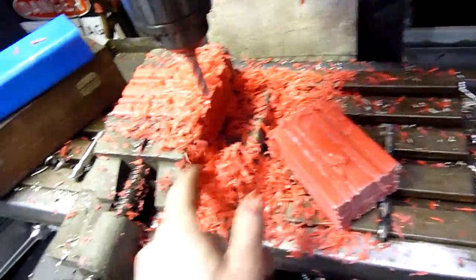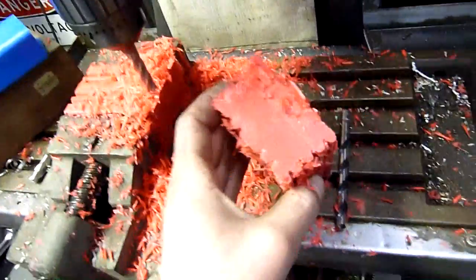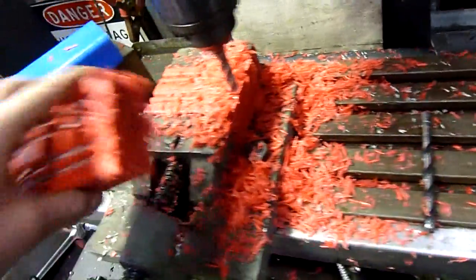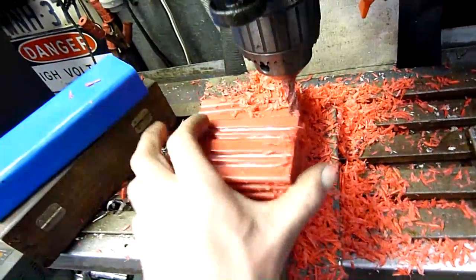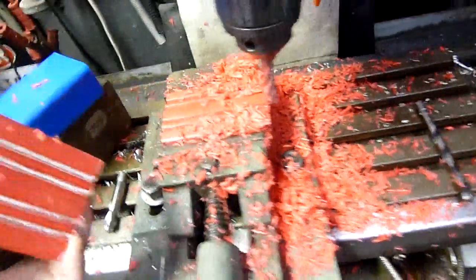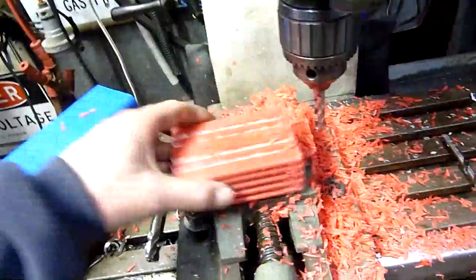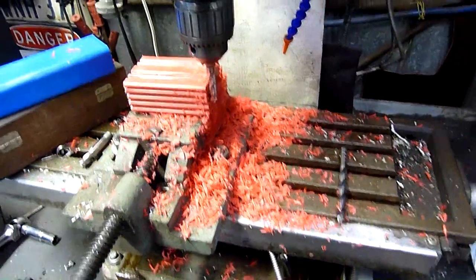There we go. I didn't want to go too low because there's a bolt there to collide with. Yeah, that did the job. Basically, he gave me just enough, which was just by chance, to make two side-by-side blocks to do the rear one, bolted down side-by-side with a 10mm gap, which is just the size of my long series end mill. By fluke, I didn't anticipate that, but it's perfect. And it's got little ribs in it too, which is helpful. So that is the rearmost block done.